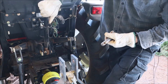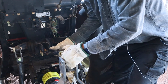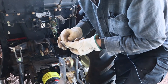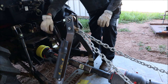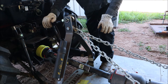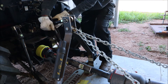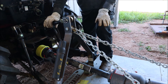For the top linkage, take out the pin and lock it in. This one is adjustable with a screw adjustment, so it doesn't matter if it doesn't line up exactly — just adjust and push it in. Finally, do some adjusting on the adjuster: I like the chains to be tight and I like the slasher to cut at the front first, so I set it slightly lower at the front. Once the chains are tight, lock the locking nut and it's done.